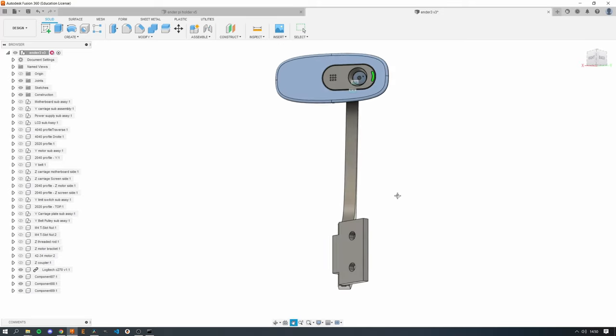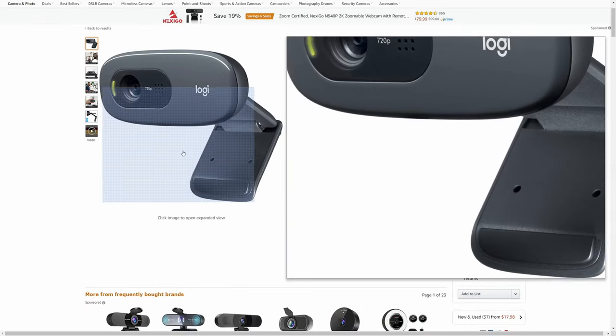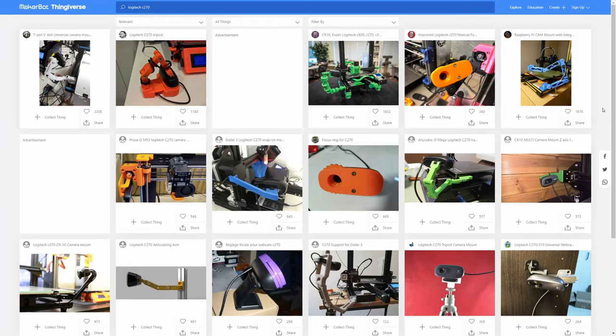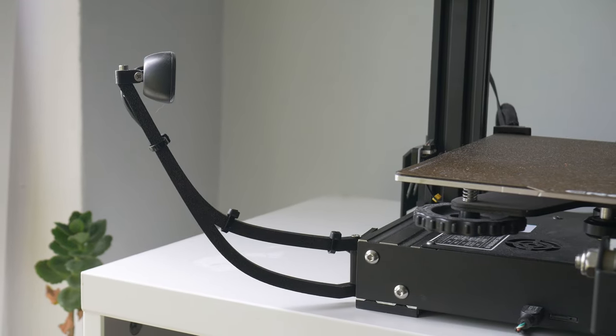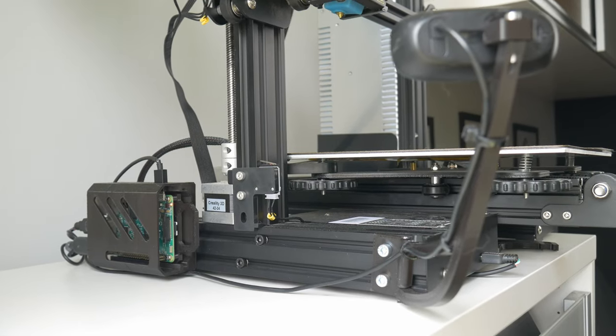Next was the camera holder. I'm using a camera that I found in my projects box — it's a Logitech camera. The image quality is pretty bad but it works okay for OctoPrint. The field of view is really narrow so I had to design my own holder to see what's actually printing. I tried looking at some models on Thingiverse but nothing was really working for me, so I designed my own simple hinge system with an arm that you can attach the camera to. If you would like to use this holder for a different camera, you can just redesign the top piece to create a different attachment. The camera holder, the Raspberry Pi holder, and parts used for this project are in the description.